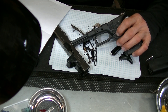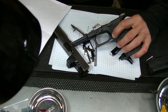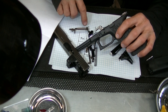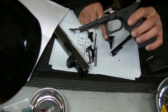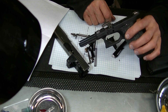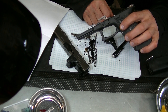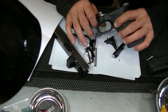Some people like no take-up; some people want a nudge of take-up or even a full amount because it's incorporated into their muscle memory from shooting Glocks. I'm going to change out the bar, soften some things, take care of the trigger safety, rebuild the housing, and use a different connector other than the V4 to change the break travel and get this thing breaking and resetting as quickly as possible. I'll stop the video now and Part 2 is coming — we'll see how it compares against these lines.